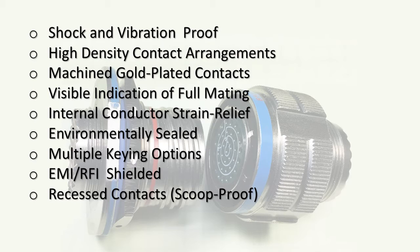They're environmentally sealed by that rubber, so we want connectors with gaskets and O-rings to protect them. These have multiple keying options, which prevents you from cross-connecting two connectors using the same shell size. If you have five connectors on a bulkhead, you want to make it impossible to hook cables to the wrong connectors. Otherwise, use dissimilar styles, sizes, or number of contacts to prevent mistakes.